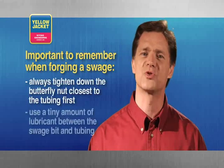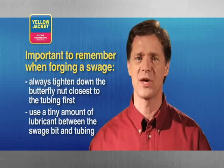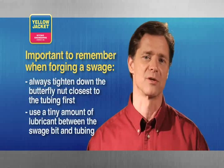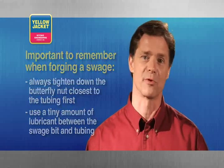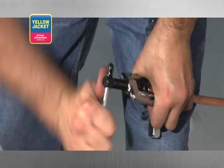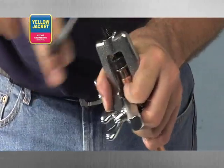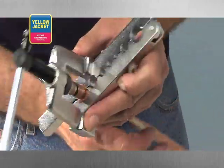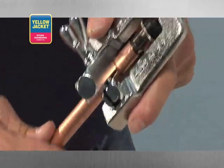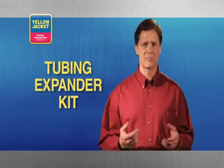It's also a good idea to use just a tiny amount of lubricant between the swage bit and your tubing — not enough to contaminate your braze joint, just enough to offer a little lubrication, especially if you've performed a lot of swages with your bit. The only thing left to do is feed the swaging bit into your tubing. If you notice the tube is slipping in the bar, back out the bit and re-tighten your bar, as allowing your tubing to slip will ultimately render your bar useless. While your bit is entering your tubing, note whether you've extended the tube out past the bar enough — if your tube is set at the proper height, your swage won't bottom out on the bar.